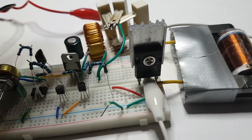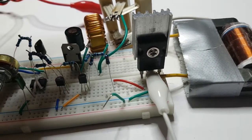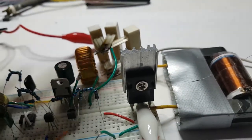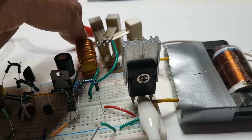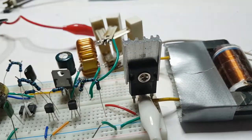Between them it gives me just over an ohm — I think it was 1.074 or something like that, if I remember rightly. The resistance across it, and it wanted to be one ohm at five watts, so that's good. I didn't think it'd get warm. The MOSFET's not terribly warm but it's not really doing a great deal, and the circuit can go up to 18 volts.